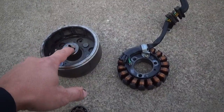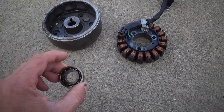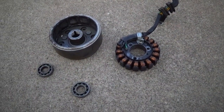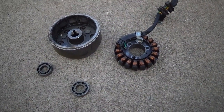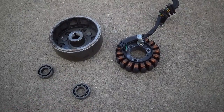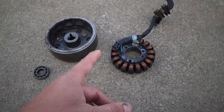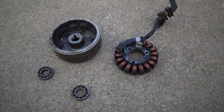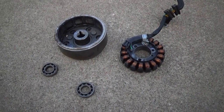What I've got to do here is make a shaft that fits this, fits these bearings. These bearings aren't sealed, so I'll have to make it so that they are inside of the casing — make an outer casing for it. Some of the benefits are it'll be about half the size of a typical alternator. It doesn't need to be energized, so if it's just sitting still doing nothing it's not using any current. Once it starts spinning it'll produce current. It's also made to be run one-to-one, whereas a car alternator would require two, three, or even four times overdrive in order to produce current.